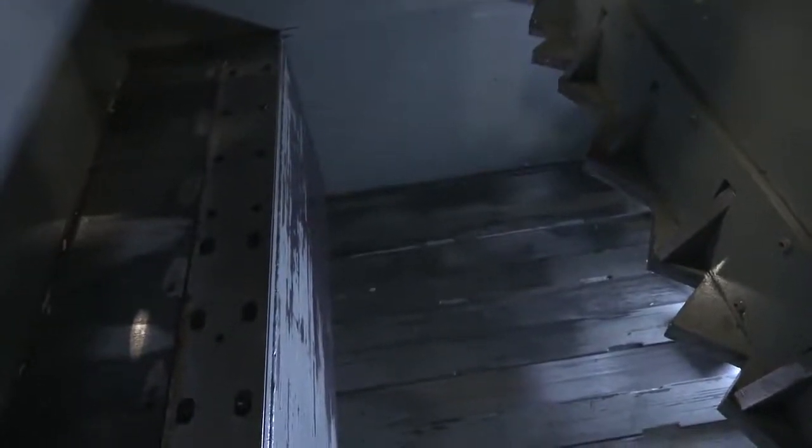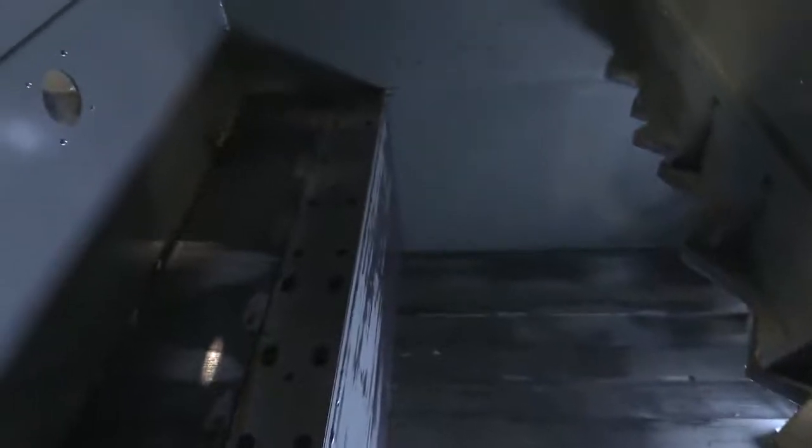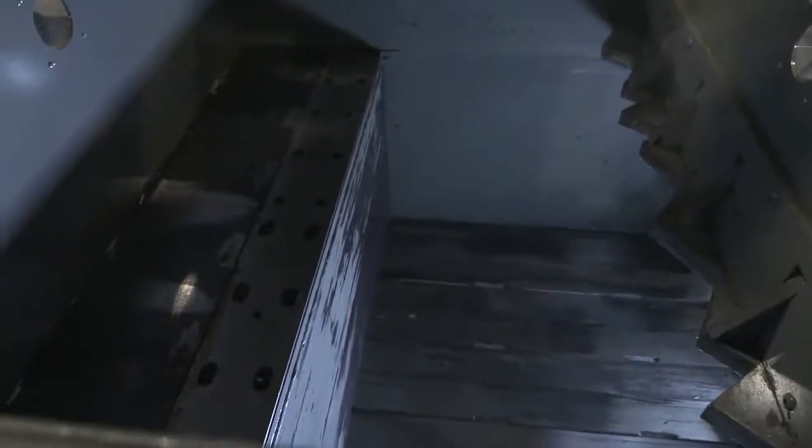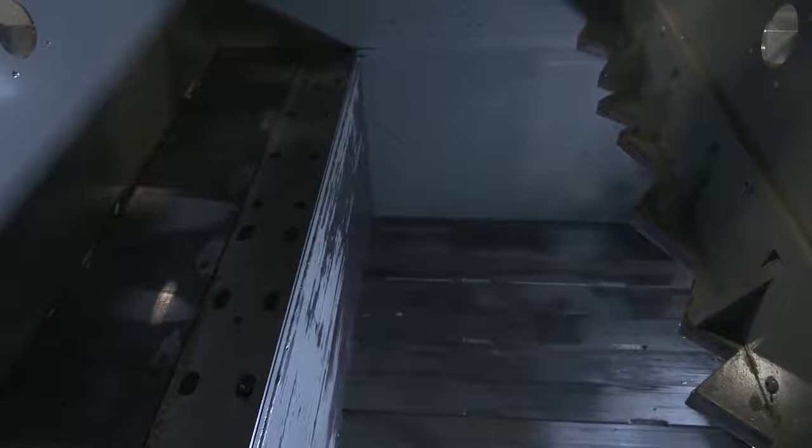As we're looking inside the machine, you can see the progressive shear on the front where it spreads the material out — you're not just cutting across a single span. On the back side, there's an angle on the shear that goes on the ram. An important part of this is that we're not using standard hardened material — this is T1 tool steel, inch and a half thick.